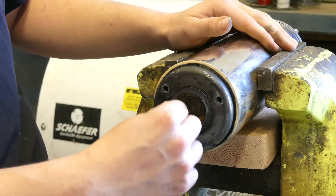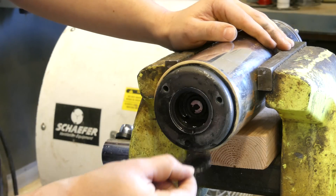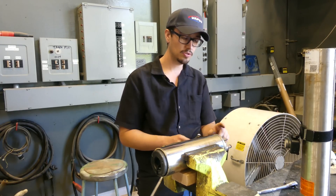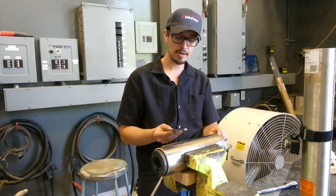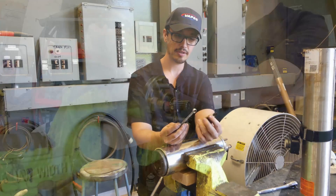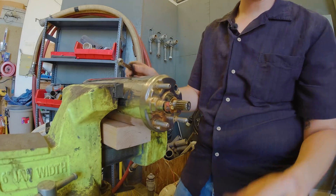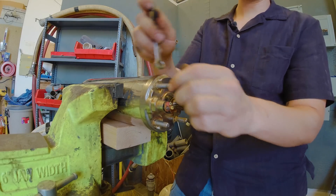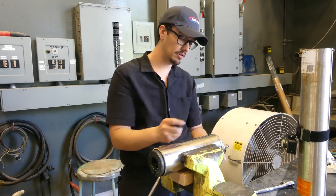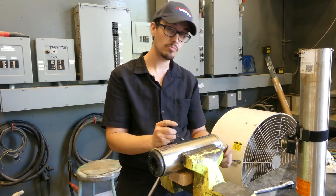Here we've got a section of the diaphragm where we've got some liquid. The next thing we're going to remove are the screws that secure the pump end to the motor — I've got a number nine wrench here. Those come out looking just like that. They're threaded on both sides: one side so you can put the nut on to secure the pump in place to the motor, and the other side threads into the motor. Now this motor isn't going to just simply unbolt and take apart — these are sealed, epoxy-potted motors, so we're going to have to do some cutting to get it open.